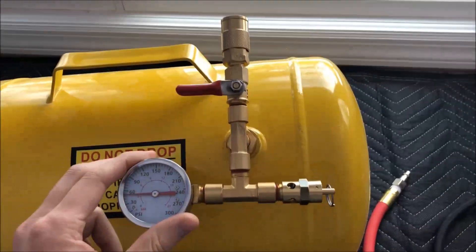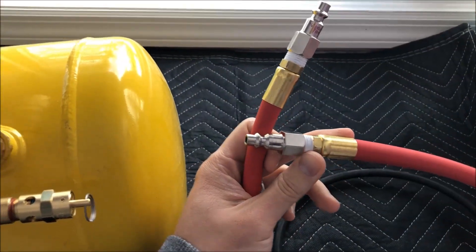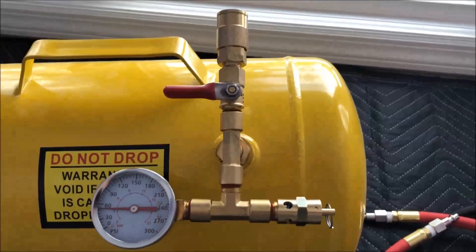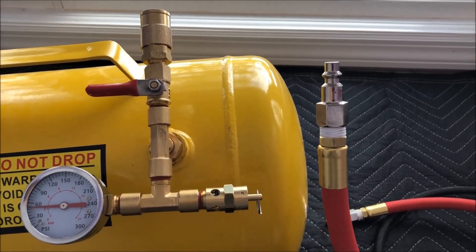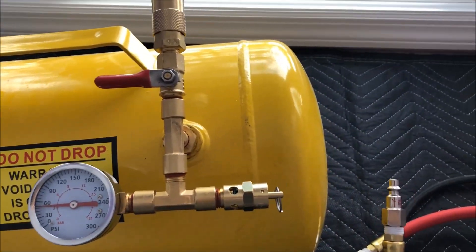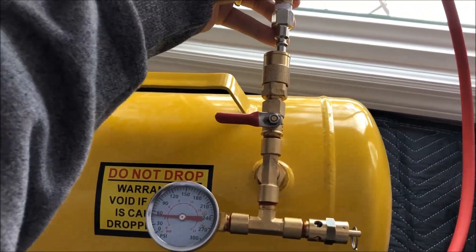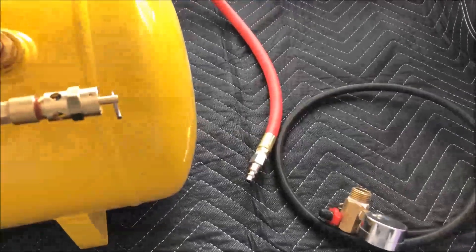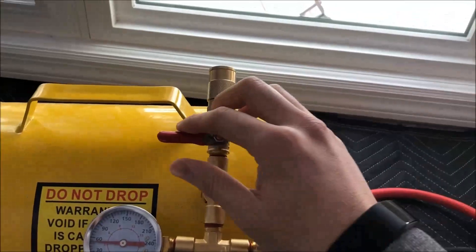So what I'm going to do in order to fill this is I have a three foot jumper hose, and what I did was put two male ends on it. One male end will come into this side of the hose, the other male end will go into the air compressor. Just remember, the reason that you put this ball valve in is to lock the air — if you need to put in one end of this hose and there's pressure or air on the other side, when you plug it in it's just going to spray all over the place. So what you want to do is lock this end and plug this end in first. That will prevent any air from leaking out the other end. If you plug this into the air compressor and the air compressor has air in it, it's just going to blow in your face. So don't do that. That's the reason for this ball valve.